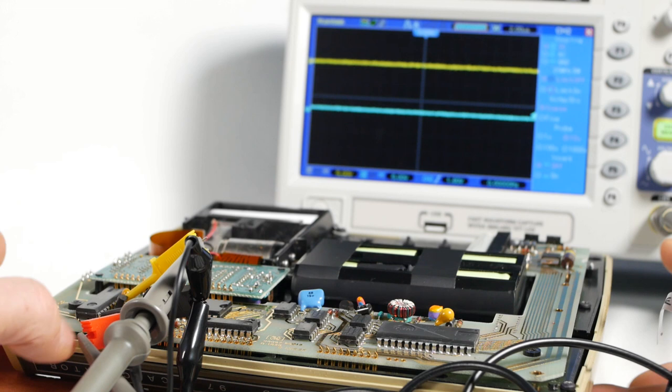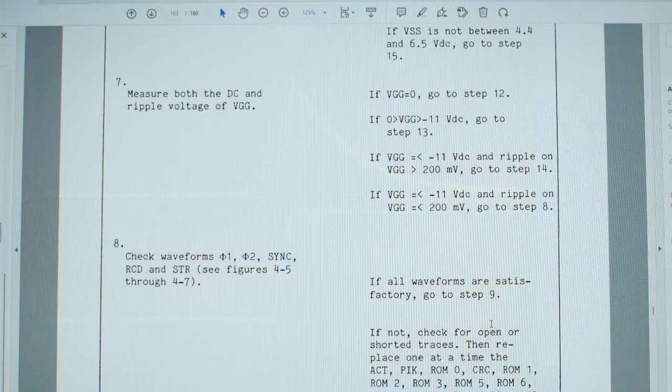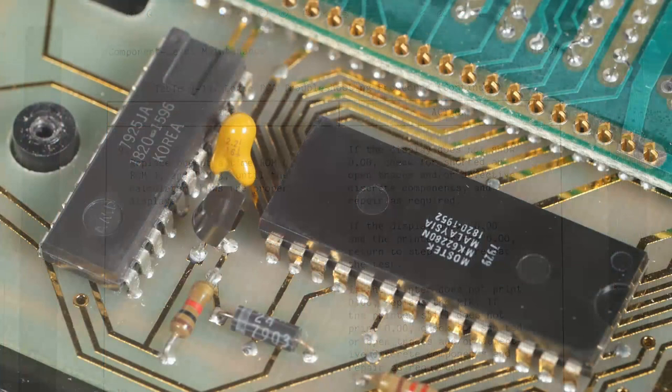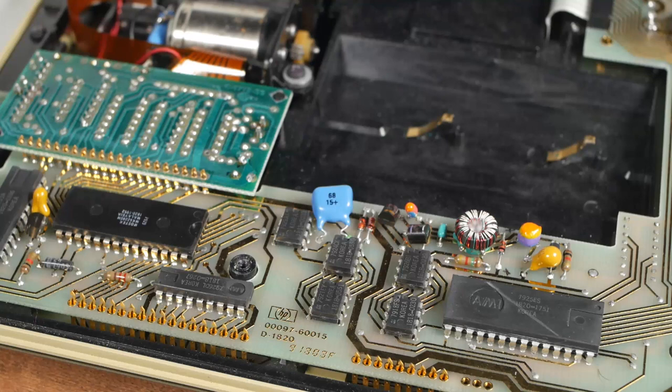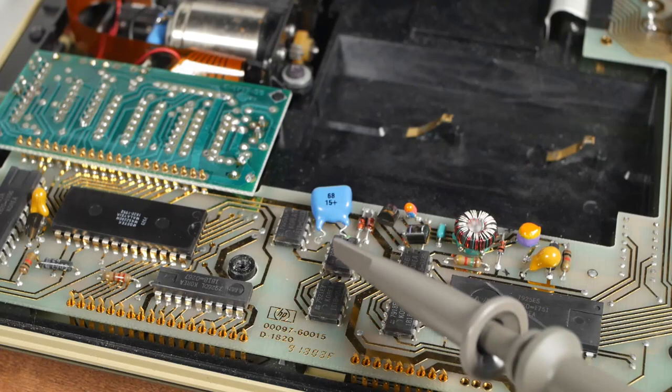More trawling through the service manual gives a load of tests to perform with an oscilloscope, all of which came out okay — voltages were correct and all the waveforms were as they should be. The manual goes on to say if all the waveforms are correct, replace one at a time ROM0, ROM1, and ROM3 until the calculator works again. That's where I'm up to at the moment. The chips for this machine appear to be made of pure unobtainium, and finding a suitably priced donor machine seems unlikely. I've replaced a couple of tantalum capacitors that were way off their specified value, and a couple more that were a little bit off, but that's made no difference. I'll still keep checking just in case I can find something other than a blown chip that's causing the problem, but all my senses say it's a failed chip, probably one of the ROMs.